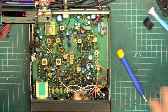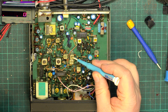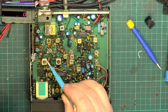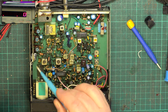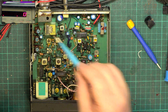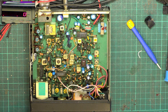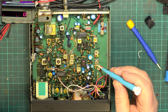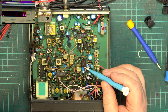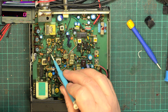To do the tune-up for transmit, it's that coil, that coil, that coil, and then the obvious three coils for peaking. We're not going to touch the VCO-related components. The RF meter is set by that preset. The deviation is that preset. Low power is adjustable via that preset.